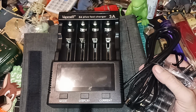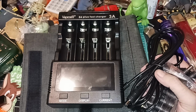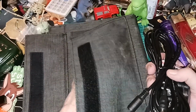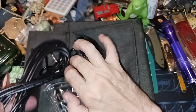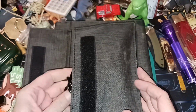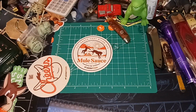But just something like that. If you needed medical stuff, you might want one that would power a small refrigerator. Now you're not going to run all of your voltages directly off of a solar panel. Like, the most you could do is maybe a fan, and even then, if it gets cloudy or whatever, the speed would go down. It's usually better to run something through a battery, because you're giving it steady power, steady voltage, and everything like that.